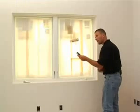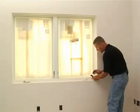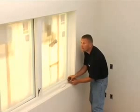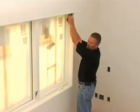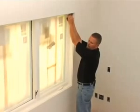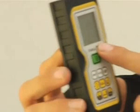That point fits into an inside corner — let's say this window jam here. So I can go inside that corner, point to the opposite corner, take a measurement, then put the laser into the other corner, point at the opposite corner, and take a measurement. And if they match — which in this case they did — that means the window is absolutely square.